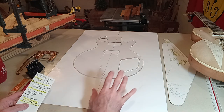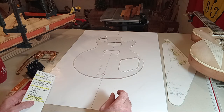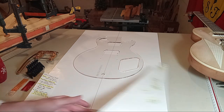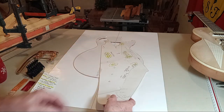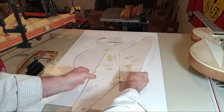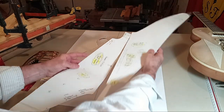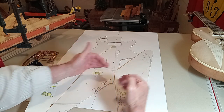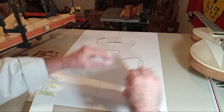Typically what I do is work from half templates and create a master template, and I may even take that master template straight to a piece of half-inch plywood or acrylic. At a minimum, cut out two templates so you can go to your lumber store and start laying them on boards. You might find a board that's nice and wide but not quite wide enough — maybe you slide it up to a 10.5 or 11-inch board. Start with paper and pencil, and the sky's the limit.